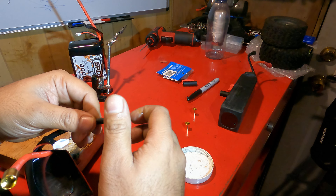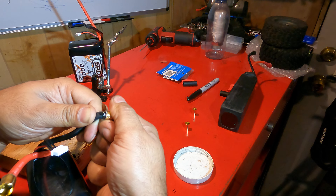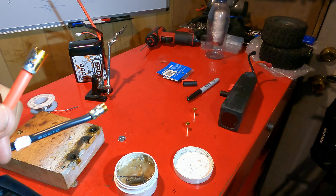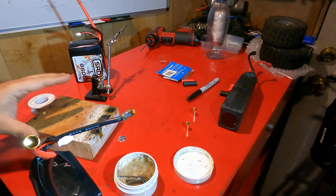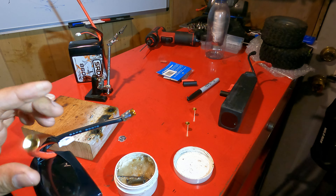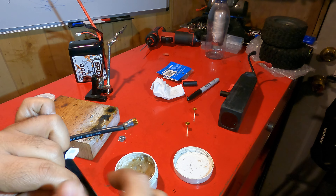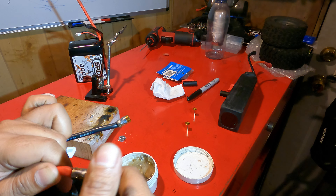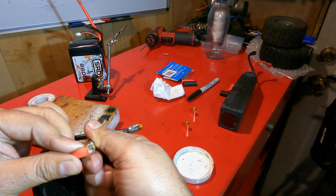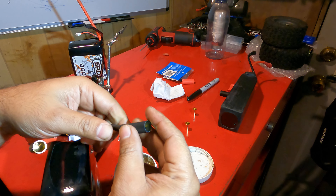You do need to check your connections. Once this is cold enough, if you're trying to pull on this you should be able to look in there — this is a perfect good connection. This one is still going to be hot so I don't want to touch it yet, but you can see from the hole it's nice and soldered. Once it cools off, you want to pull on it. If you can pull on it and it doesn't come off, your solder is perfectly good. Look right there — I can see it in there. Look at my solder, awesome in there.